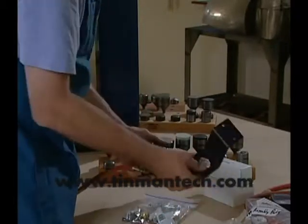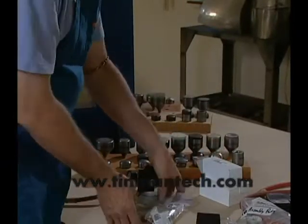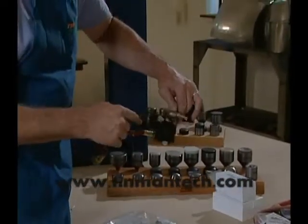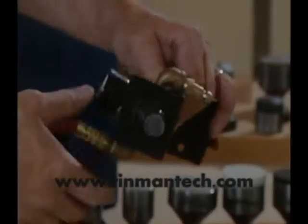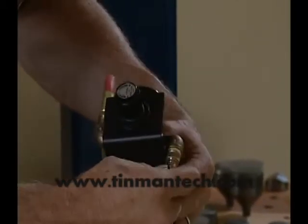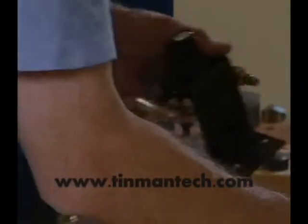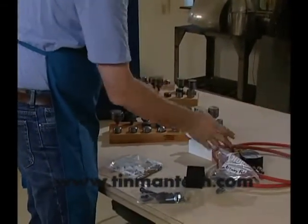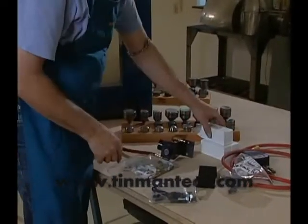What you get is the bare bracket, you get the regulator in the box with the nut, and you get a bag of fittings like this that has the elbows in there. You'll have to use some rector seal, which I like — it's a very good material for sealing threads and makes things very, very tight. The Truflate fitting goes in the back; this goes down to the foot control and we have a quick release on that. You get this nine-foot or ten-foot air hose and the foot control with the fittings — all the fittings are in the bag.